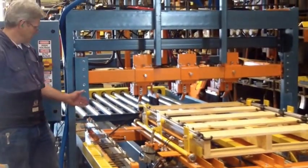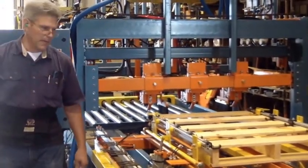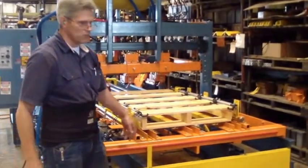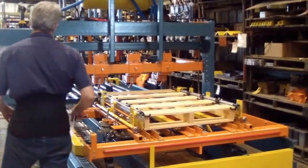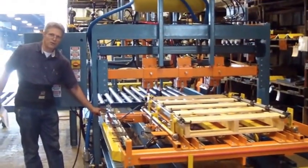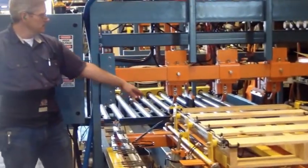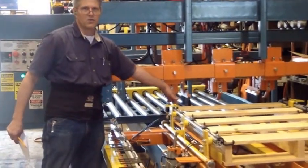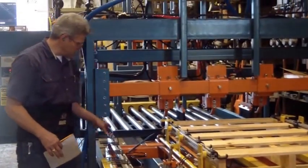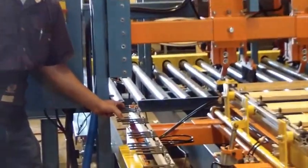Center to center, you have to first drive your first nail in automatic, and that gives you a 0 point. Same thing for the bottom station. I didn't go over that earlier, but it's the same thing. Set one tab up, beginning point at the 0 point, run it through, nail the first nail, stop it, see where it nailed. If it's correct, you can do your spacing. If it's not, you can adjust that. Remember, bottom for the bottom, top for the top.